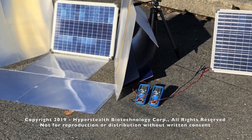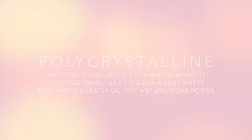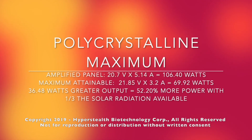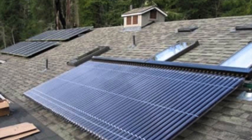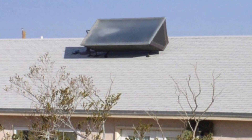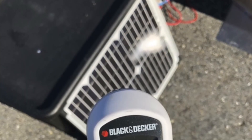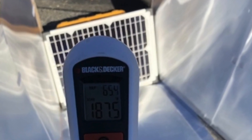Adding the side lenses and mirrors achieved 49.59 watts greater than the control panel. Compared to the manufacturer's stated maximum, I was able to provide 38.5 watts more than maximum, which is 52 percent more power than achievable under perfect conditions. Domestic water heating is the second largest energy use for Canadian households, accounting for approximately 22 percent of total household energy consumption. The most efficient water heater temperature is typically around 145 degrees Fahrenheit. While non-amplified panels don't reach this temperature, our amplified panels do and then some. In some lesser quality solar panels this heat can cause permanent damage.